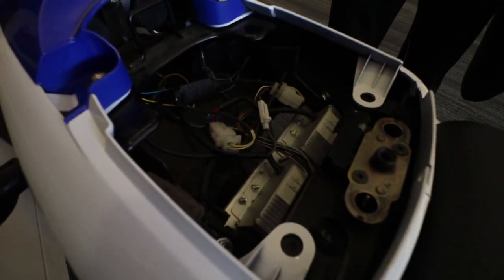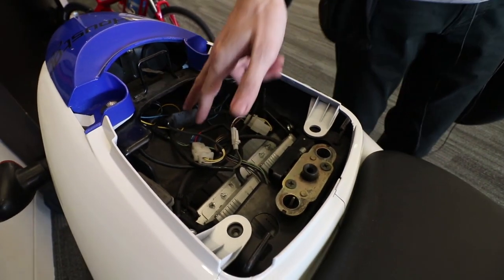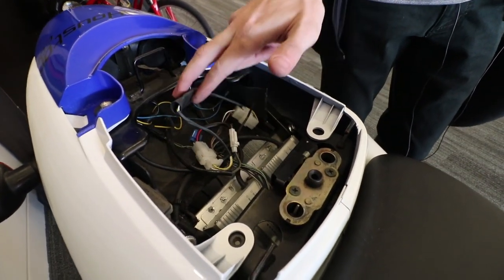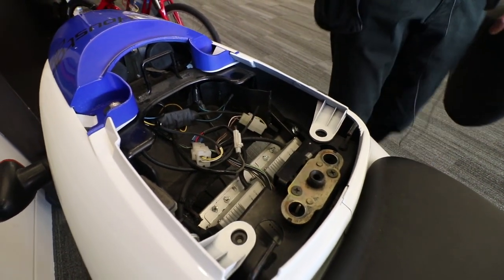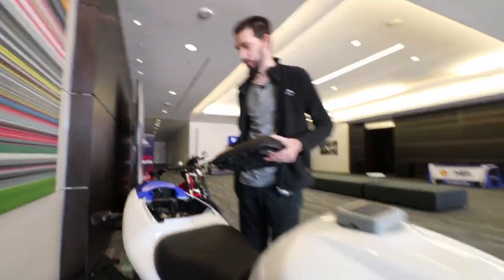I did think about adding a potentiometer in line with it so I could vary the charging if needed, but the BMS and everything else just handles the change in there quite nicely. This is a little safety thing I put on which flashes the back brake light in a pulsating flash to try and get someone's attention before they run me over.